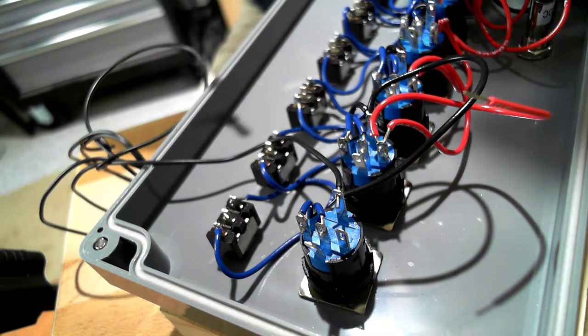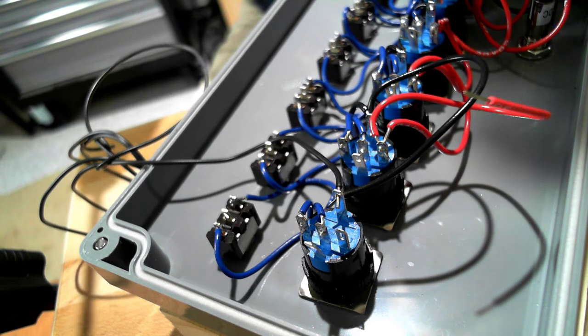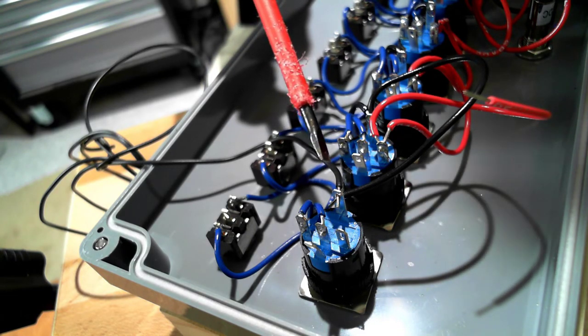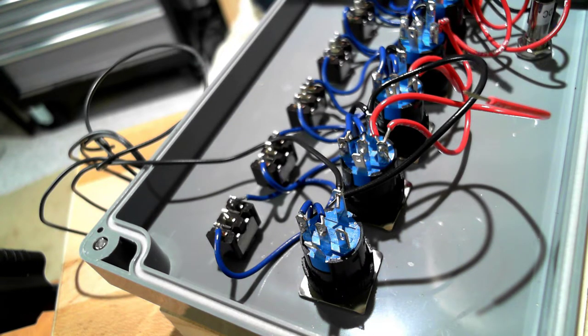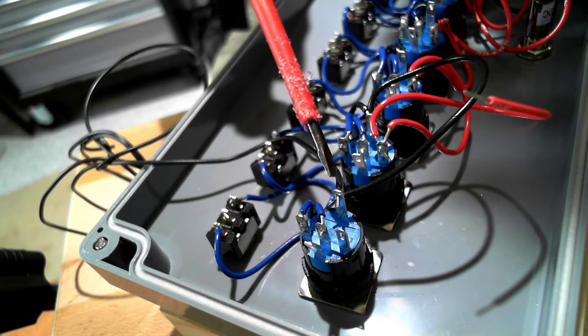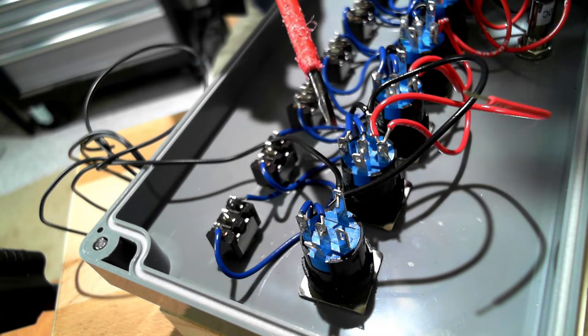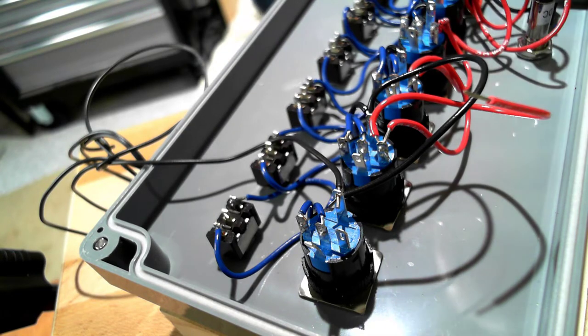This is going to be the first of the long lengths of wire that we connect inside the box that go out the flying leads that come out of the box to hook to your I/O. We're going to start with the negative connection, or the negative side of the power supply that's jumpered to all of these LEDs and to the pilot light. So you see we have two wires through that eyelet. One of them is jumpered back to this negative terminal. The other one is a 36-inch lead that's going to be part of the connection out to the I/O.